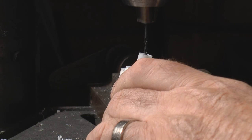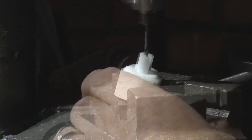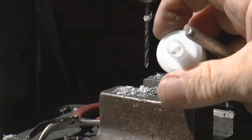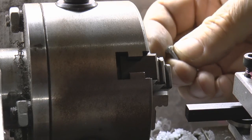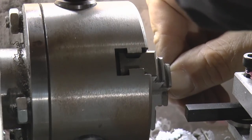Now we come to a slightly tricky bit. We've got to get a hole through from the inside of this slot to the front face so that we can get a wire through. We've managed to get a hole through at an angle into the back there. I'm trying to use the original battery pack if I can. To do that I'm going to put a contact in the end — an M4 countersunk screw about 10mm long — and drill a hole through the middle for the wire to connect to.